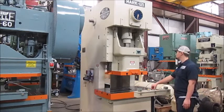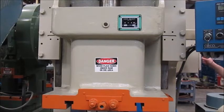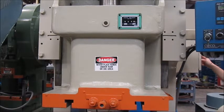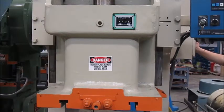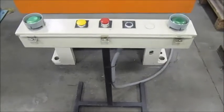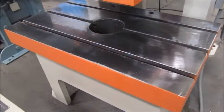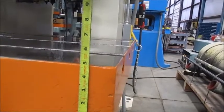This is the emergency stop. This is the die plug. This is ram adjustment up. This is the upper limit. This is ram adjustment down. This is the lower limit. Here's the T-stand for the press. And here's the bolster plate — it's T-slotted right to left, and it was cut down to 1.75 inches thick from the bottom. There's a hole in the middle of it.